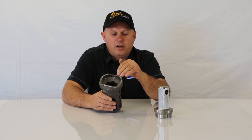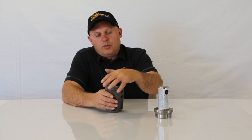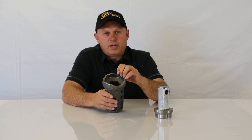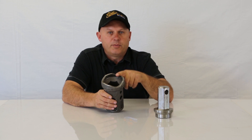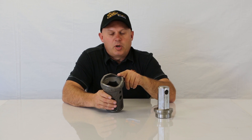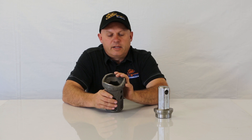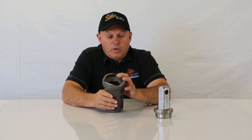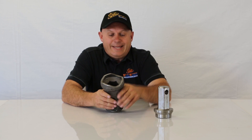If you had a problem with one of your welds and there was a little bit of a fault in it, with other styles of hub adapters that are available, when you go to use it and there's some stress on that fracture, it can just fracture straight across. What this does is it stops it from doing that. So even if you have a problem with your weld that doesn't quite penetrate properly, it's less likely to fail. And if you do a really good weld on this, this thing is just absolutely the strongest you can find anywhere.